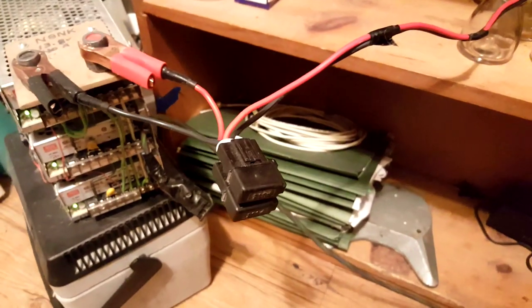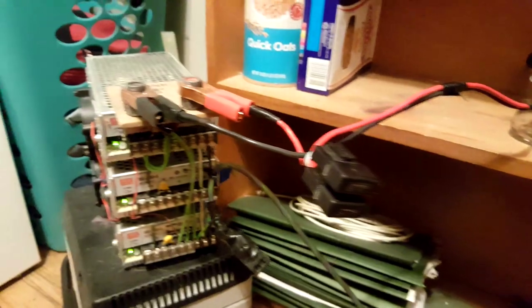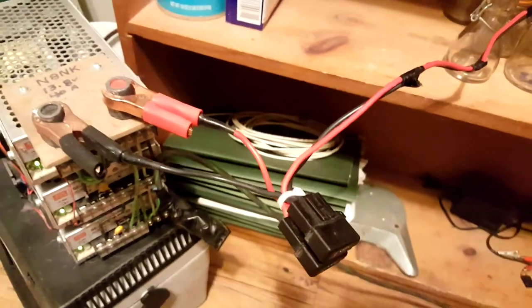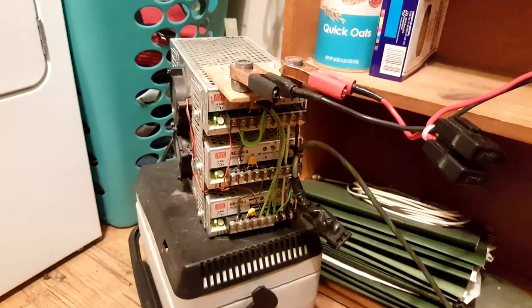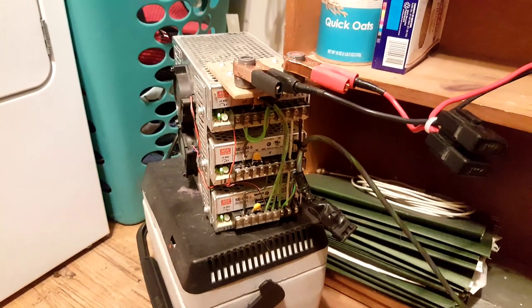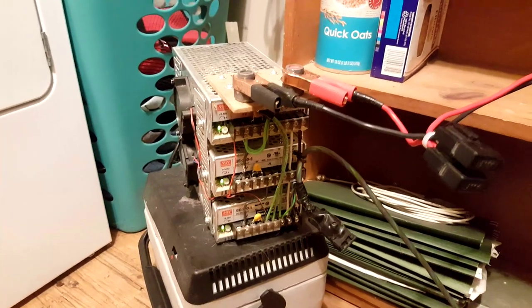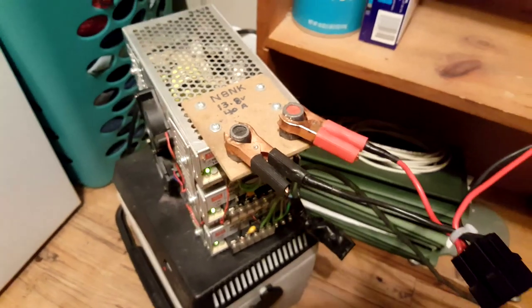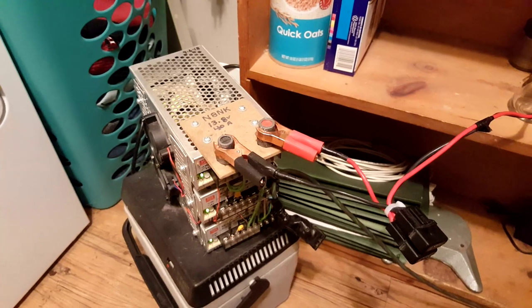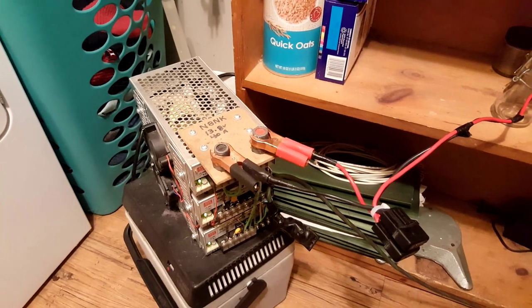On this end of the power cable we have the rig's fuse holders. The zip tie wasn't on there before — I added it for strain relief after I figured out what the problem was. This rig hasn't been used a whole lot. The first thing I did was take my voltmeter, connect the probes to those clamps, set the rig to CW at 100 watts, key down — and sure enough it dropped a tenth of a volt, like I'd expect.